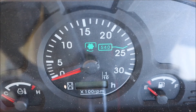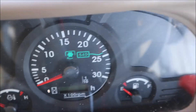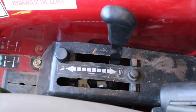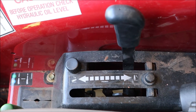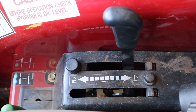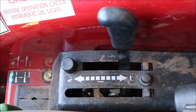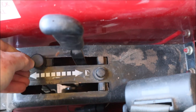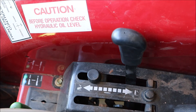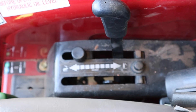You can set the height of the slasher with your three-point linkage control lever. It has to be close to the ground before it switches on — that's a safety feature. The lever is graduated, so once you get it down to the level you're happy with, you know which graduation you're working on. There's even a lock so when you lower the slasher you know it's automatically at the right height you've set.